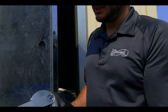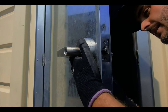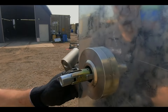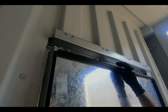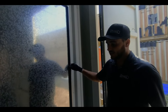For this door, what we include standard is the locking door lever — keyed on the outside. Two bolts go right through and squeeze the plate to the outside, then you just slide on your interior lever. This door closes really nice and tight. We have that automotive grade door seal, which is meant for things that move and high use — like a car door. So this door seal moves with the door. If the can moves, the door seal moves and it's not fixed in one location, so it'll always work well.